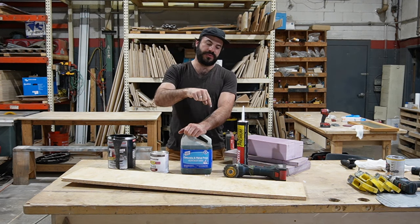Now, the foam that we use is called extruded polystyrene foam, which is different than expanded polystyrene, and that's an important difference. Expanded polystyrene is the little white foam balls that you'll see coolers made out of and things like that, and also insulation. Extruded polystyrene is a totally different animal. This has not only a better R value per inch, but it's also much denser and has a higher compressive strength. So we like to use Foamular, which is an Owens Corning product. Foamular 250. The 250 means that it has a 25 PSI compression rating. You can get it in the 150 and it goes all the way up to 1,000, 1,000 being 100 PSI.